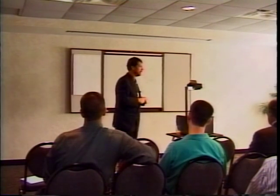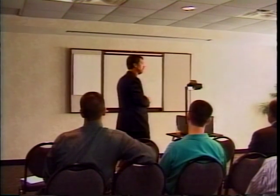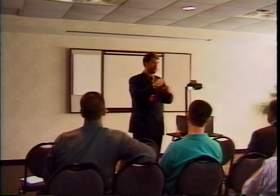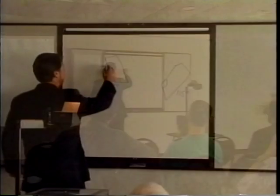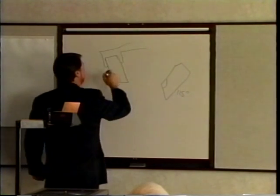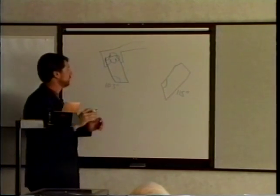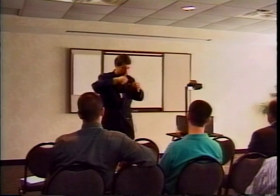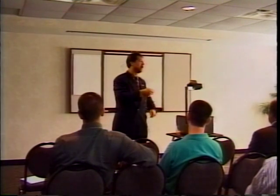And speaking of that, maybe talking a little bit about the different shellacs or attachment procedures that people use. I know that when I first started messing with the escapement in school, we had the flaked shellac. You'd get that small piece and you'd have your pallet stone and your arms meet there, and you have this little flake of shellac here. You're trying to make sure you don't have too much and you don't have too little, so you've got the exact right amount of shellac on there, and you're taking it from where you're working to get it up to the flame, and you're going real slow, because if you go too fast, the air blows the piece of shellac off of there.